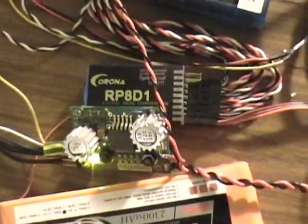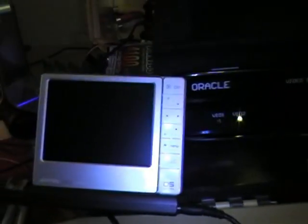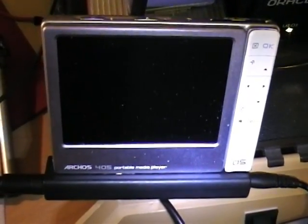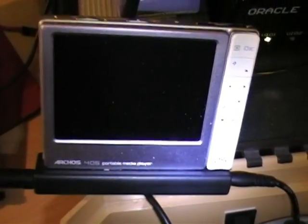So here we go — plenty of wires, loads of RF probably all around. I'll power up the tracking antenna and the ground station and we'll see. One thing I just discovered is that the Archos is actually interfering with my antenna tracker — it was making a really high-frequency noise. I'm going to investigate that. I've had a few glitches and problems but I'm getting there bit by bit. I'll just switch off.